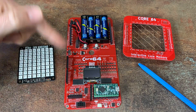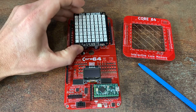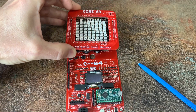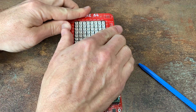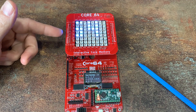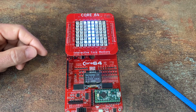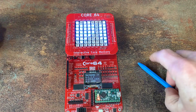All of the logic and power and control is down in this lower layer of the board, and the next level up is this LED array, and then over the top of that the core array is placed. The core array is scanned constantly, and if there's a change in state that isn't expected, or a bit fails to flip when it's supposed to, the logic knows that there's a magnetic interaction nearby.